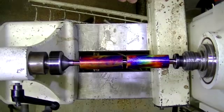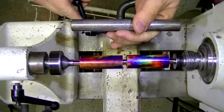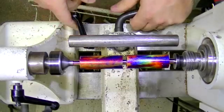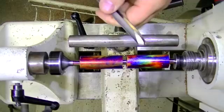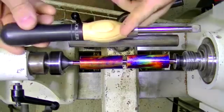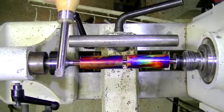It's always weird working on someone else's lathe. I'm going to start with my bowl gouge — I prefer using it just for material removal, then switch to my carbide replaceable-tip pen turning tool near the end. I got this one at Rockler — it came free with my lathe on a Black Friday special. I like the square tip to clean things up. So we'll start with the bowl gouge.